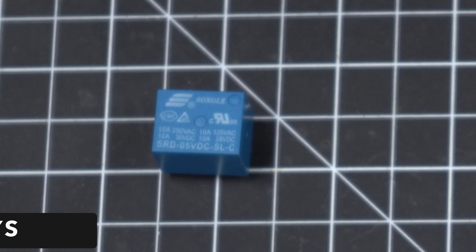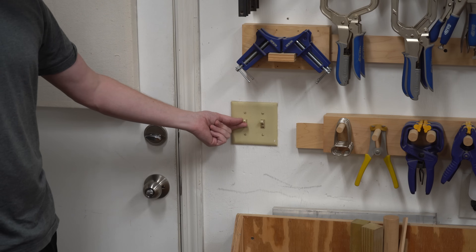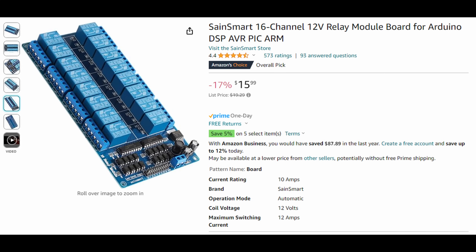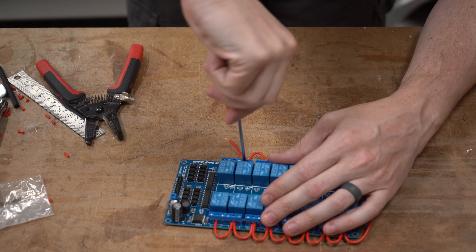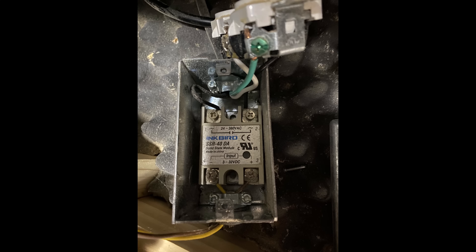So the next problem is how do we turn the solenoid on and off? For this we're going to use relays. A relay is also extremely simple — in its most simplistic form it's just a switch. Think of it like a light switch in your house, except instead of you manually turning it on and off, it will be controlled digitally. Because I had quite a few items to control and plan on expanding, I went with a 16-channel relay, which is currently going for around 16 dollars. You run your hot wire into it, looping it through each separate relay on the board, then run a separate wire to each of your solenoid valves. We're also going to use a relay to power on and off the dust collector itself. Since the dust collector requires a lot more power, we'll need a more heavy-duty relay — specifically a solid state relay, which can handle a lot more power without frying itself.